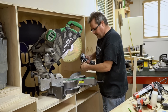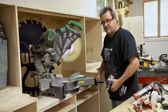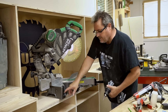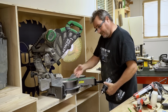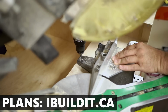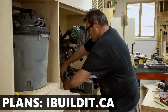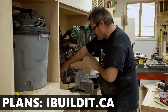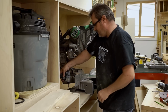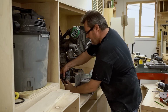I'm going to go ahead and screw it down in the back. I still have to add a piece to the front here of solid wood to build it out to fully support the front of the saw, and to bolt it over in this location because the hole is actually off the shelf, while this one up here still is. These two screws are just temporary. I just want to get the saw in position so it doesn't move while I get the wings made, and I can take the saw out again because I want to finish this shelf with clear polyurethane.